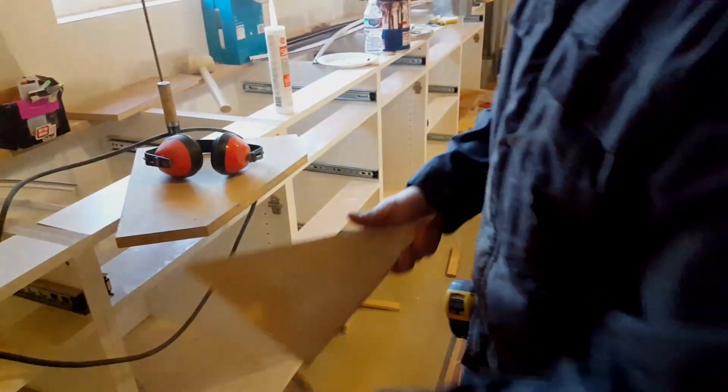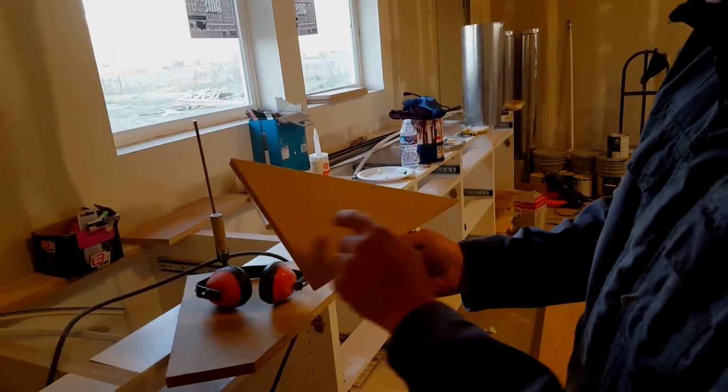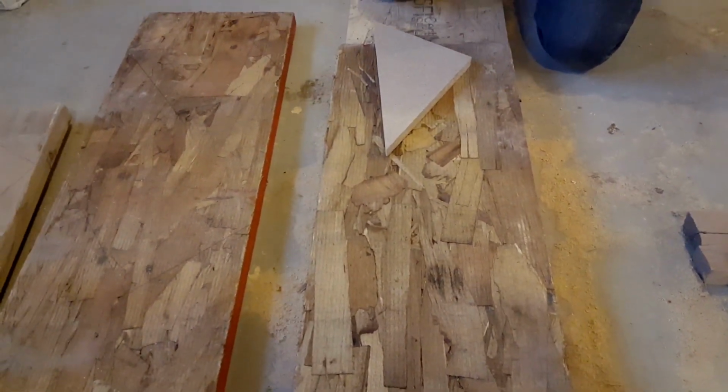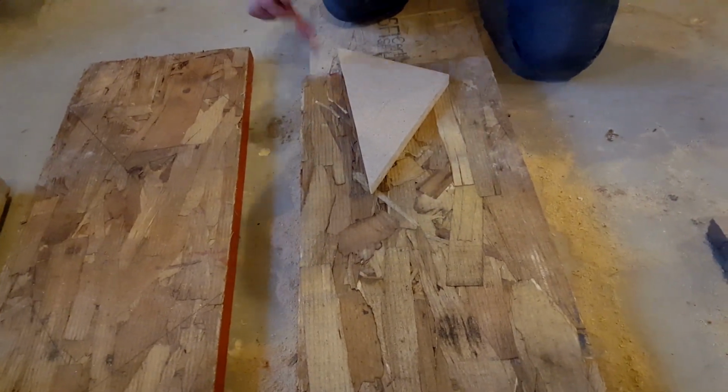Okay, so now it's pretty easy to tell. This one's shorter than this one. So this is gonna be my rise and that's my tread. Now for this one, I'm just using these little short pieces of rim board. Some people call it rim joist, but you can get it at your local lumber yard. It's the best stuff to use for stair stringers. It's really strong. You can get it in really long lengths. You've got an inch and an eighth type, and then an inch and a quarter is what you really want to use